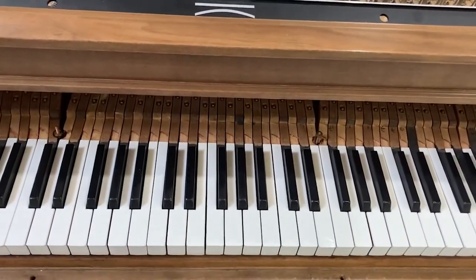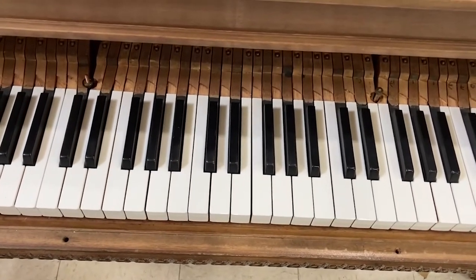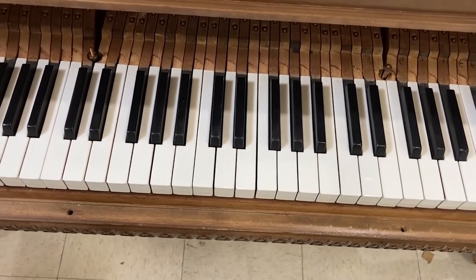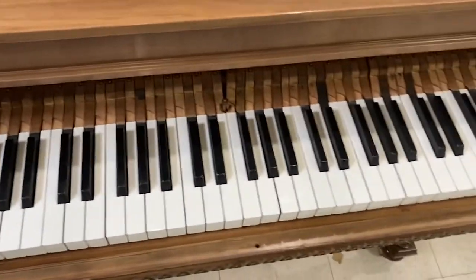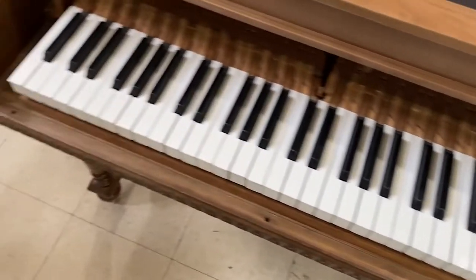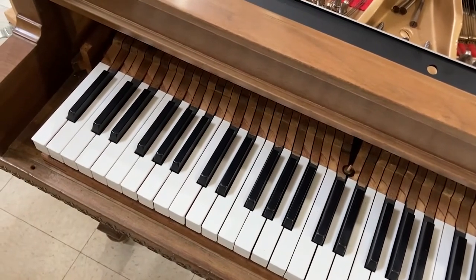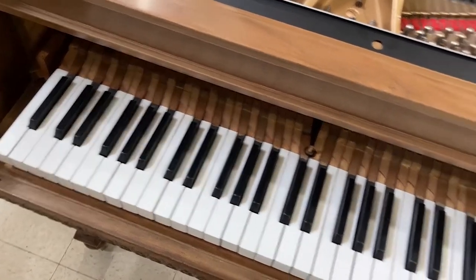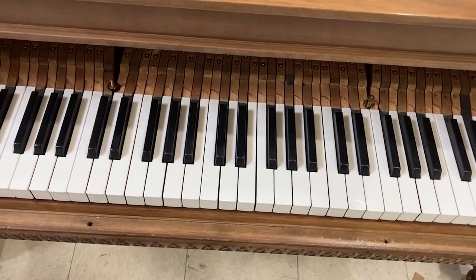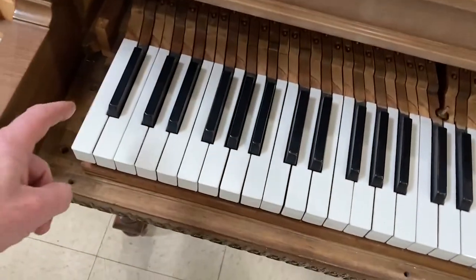One of the things I'm going to sample is: I'm going to take middle E and put a key step under it and raise that key to the level of the straight edge spanning from note 1 to note 88. I need none of the other keys to touch that straight edge. So I have cut a little slot out of two yellow punchings and placed one under the balance pin under the key of note number one and note number 88 so they are slightly raised. The middle sample sets the overall shape of the front rail.